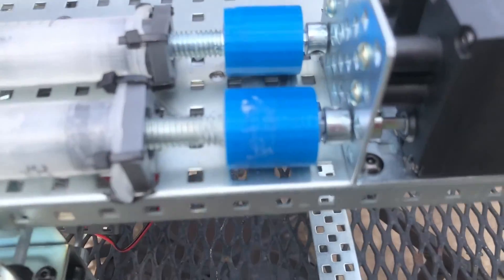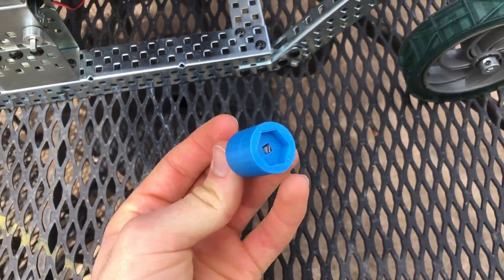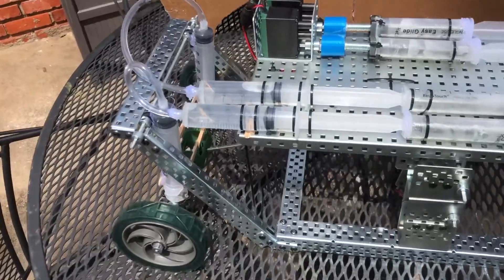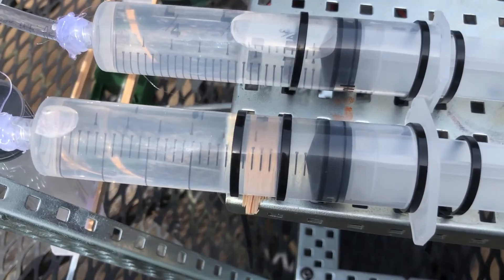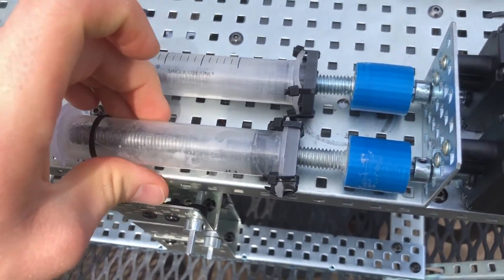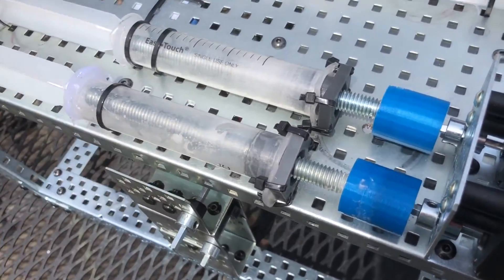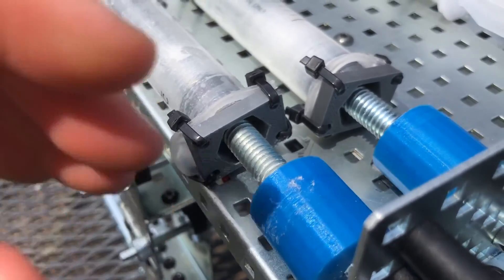Up here is the piece that connects the motor to the bolt. The VEX axle gets glued into one end, while the hex bolt gets glued on the other end, and then the VEX axle feeds into the motor. The last part of this setup is the zip ties. The zip ties all the way down here are just holding the syringe in place, but the ones up here keep these linear actuators from spinning when I don't want them to. When the actuator is pushing or pulling, sometimes it will turn the entire piece, which we don't want to happen. This is also why the 3D-printed pieces are longer on these two sides — to hopefully keep it from rotating.